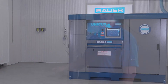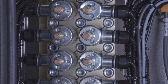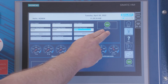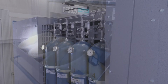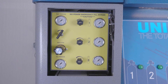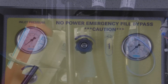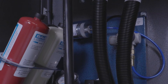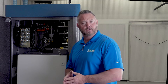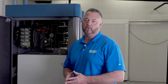As we move over to the opposite side of the system, we can see some of the standard features and options available with your Unicus 4i. The Unicus 4i is equipped with an auto cascade system controlled by the HMI touchscreen. The auto cascade automatically sends air from your onboard storage cylinders down to the SCBA cylinders being filled. In the event of a total power failure, you can access the manual bypass system to ensure when the power is knocked out, the fire department isn't. Below the auto cascade is Bauer's patented Gas Tech system. This option is available to monitor carbon monoxide, hydrogen sulfide, oxygen, and carbon dioxide either individually or simultaneously, and will automatically shut the system down and display an alarm when the gas is present.